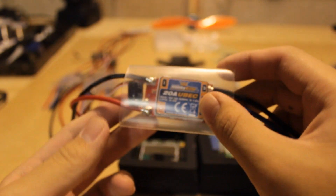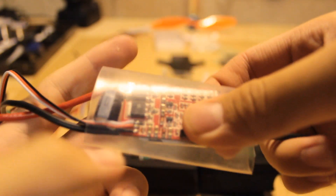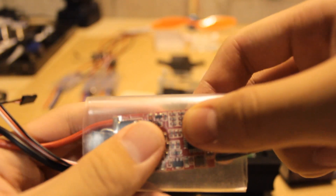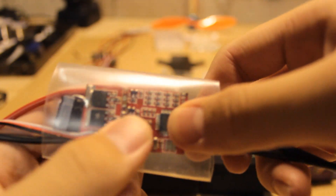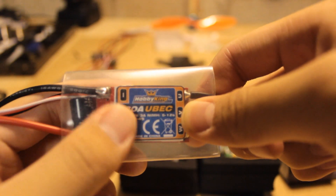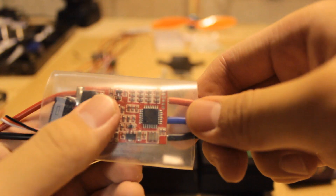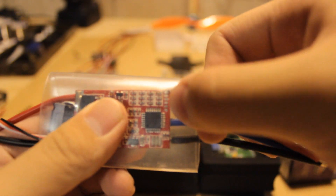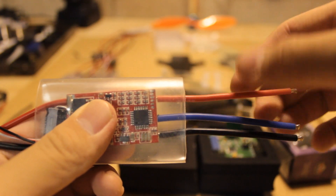The fourth group of items you're going to need is the speed controllers, and you need three of these. For beginners I would suggest the Turnigy Plush, which I will also link in the description below. For more advanced users, I go with the F20As from HobbyKing — these are 20A ESCs manufactured by HobbyKing. What I do is take the heat shrink apart, put a programmer into these pads, and flash the firmware so it's multi-rotor compatible. The Plushes you don't have to do this because they're compatible right out of the box.